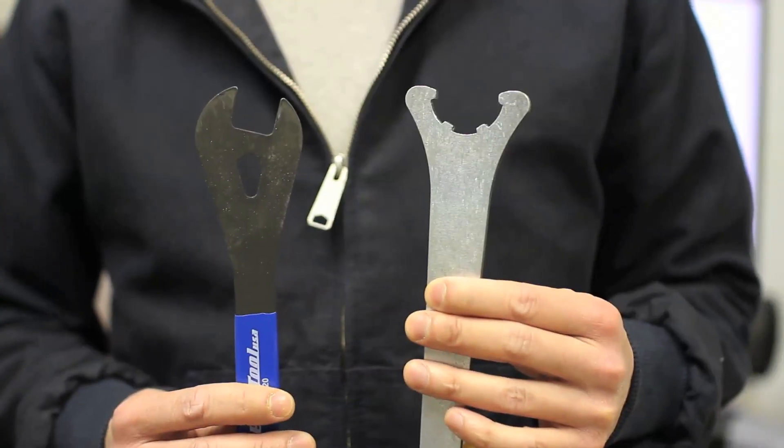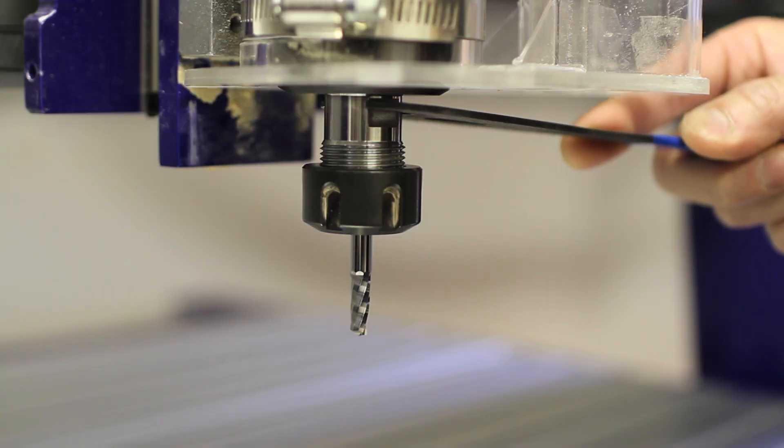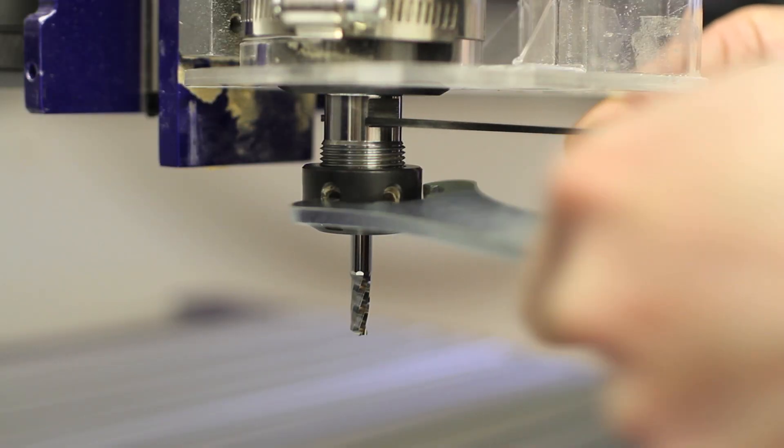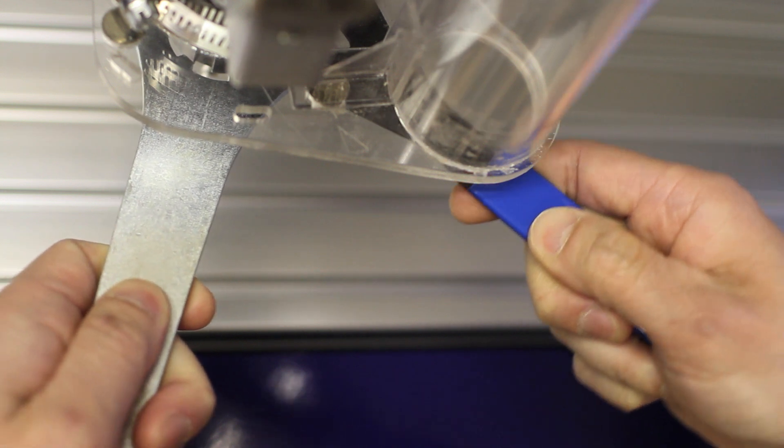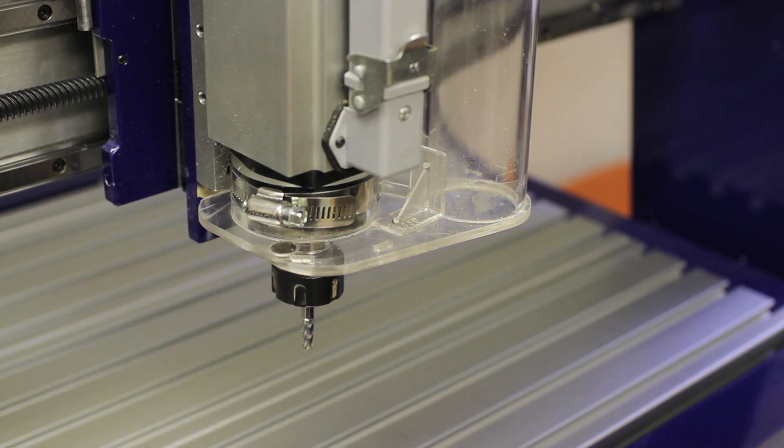And finally, I take the two mounting wrenches and snug it up. The top wrench immobilizes the spindle, the bottom wrench tightens the collet nut. Since I've already finger tightened it to the max, it doesn't take much wrench movement to get it snug. So that's it and now you're ready to cut.